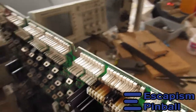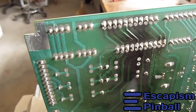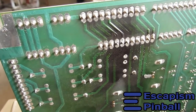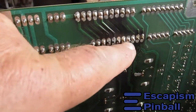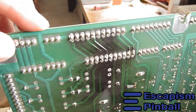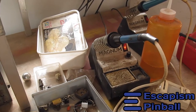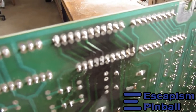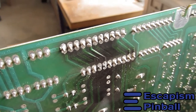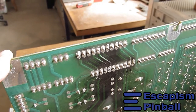I'm not going to show you how I desolder these boards, because according to the experts it comes with hard work and dedication, but basically it comes down to heating the pins, sucking the solder off until it's clear, and pulling the connector away. I do my heating with a soldering iron and my sucking with a solder sucker. And that's the story — I'll get back to you when it's done and show you what it looks like.